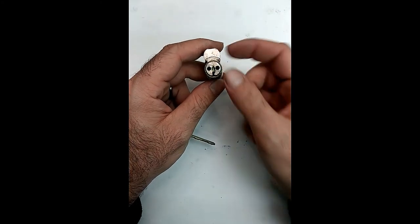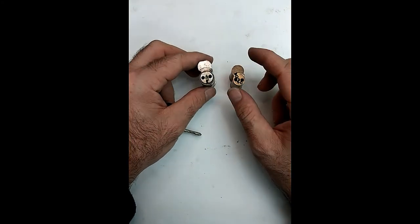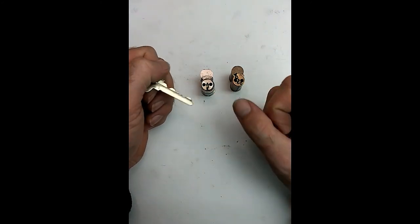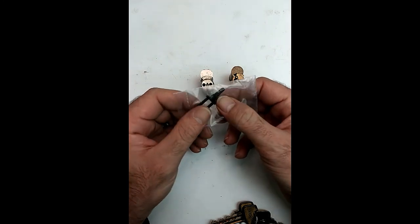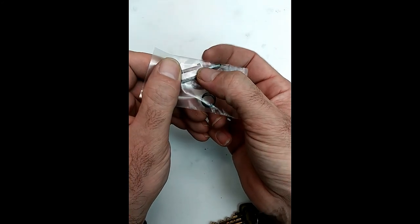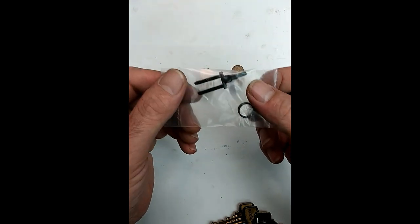One thing that's very similar between the two is you see these two holes back here. These two holes typically have a wishbone tailpiece that comes out the back, and that's what engages the lock when it's working. Old style locks had those pins pinned into the lock itself, whereas new styles have a tailpiece. These tailpieces look similar to this — you have this wishbone. In this type, it does kind of a 90 degree turn. Whereas most types, the flat tailpiece just simply continues off the prongs. This one's made by Falcon, and I keep it around because of that little 90 degree turn.